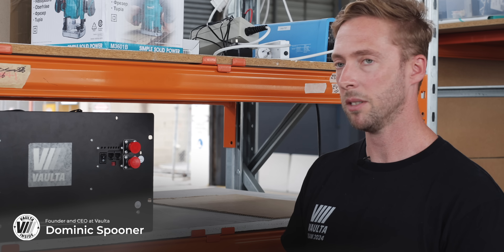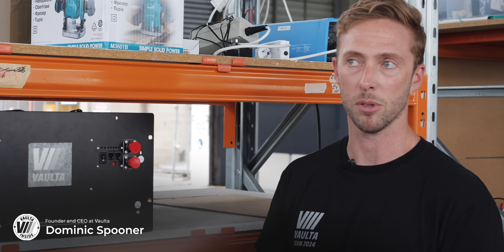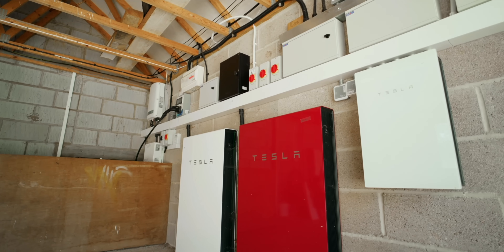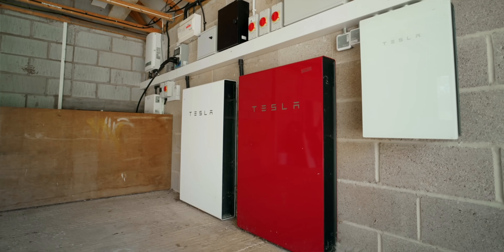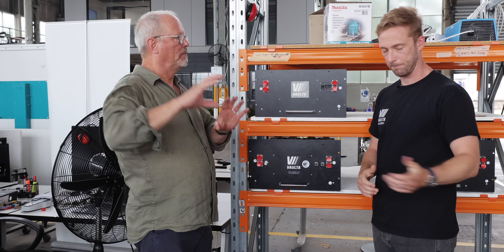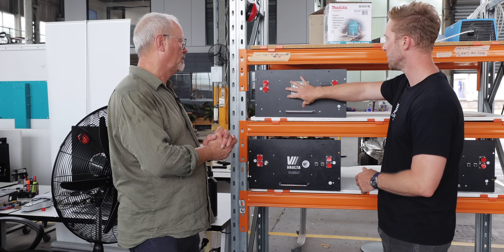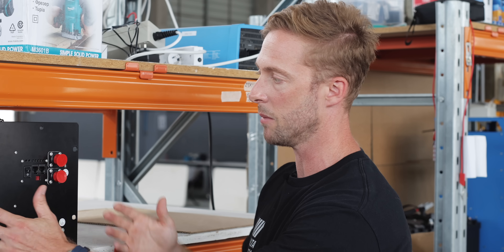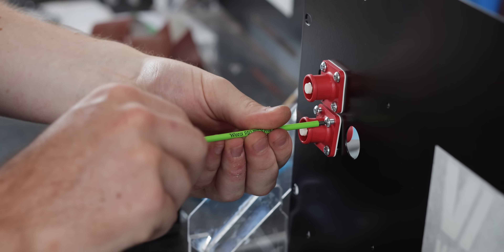It's not necessarily the most sought-after metric in the stationary storage field, but we think it's really close to being one of the most energy-dense lithium iron phosphate batteries in the world. I'm only comparing it to the Tesla Powerwall, which I think is 13.5 kilowatt hours. Yeah, different chemistry — the Tesla Powerwall is an NMC battery, and it also has an inverter built in with all the controls. Typically this would go into a cabinet-style system with additional battery management. The battery management system is in here, sitting behind this product.